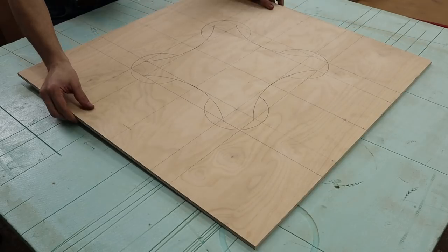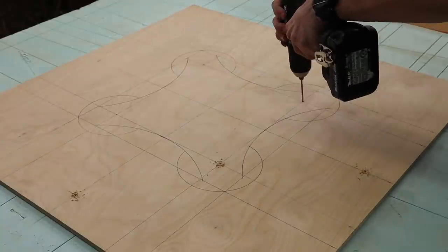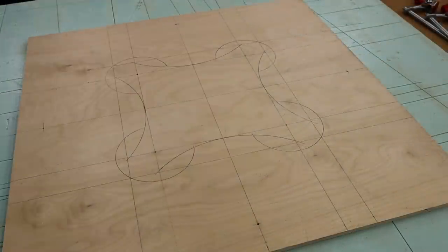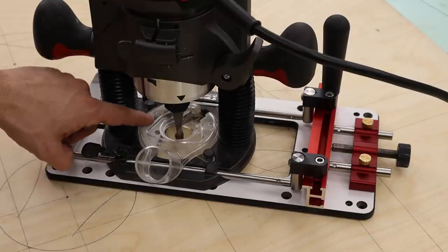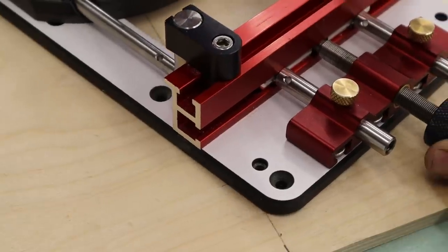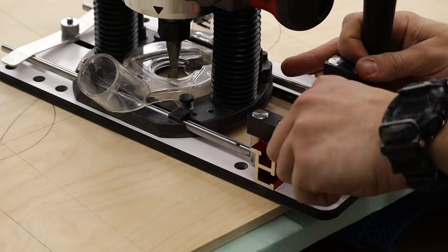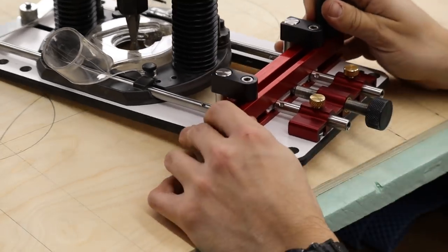Now to protect my workbench, I laid down a piece of foam. Then I used an 1/8 inch drill bit to drill all of the holes for the trammel pin. With my charcuterie board template all mapped out, it's time to get started. First I have to figure out which of these four trammel points on the base I need to use to route my arc. I started by hovering the trammel point over the hole and checking to see if my router bit could reach the line I want to cut. Once I saw that it would work, I screwed in my trammel pin with an allen key and then inserted it into the pivot hole in the plywood.